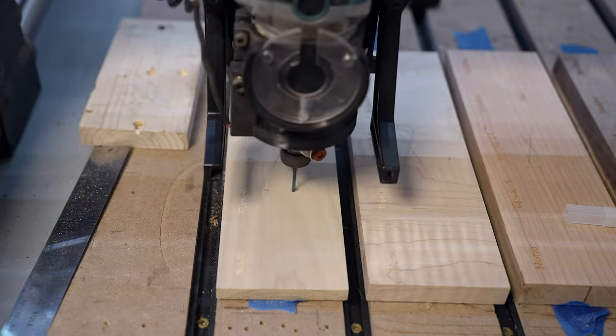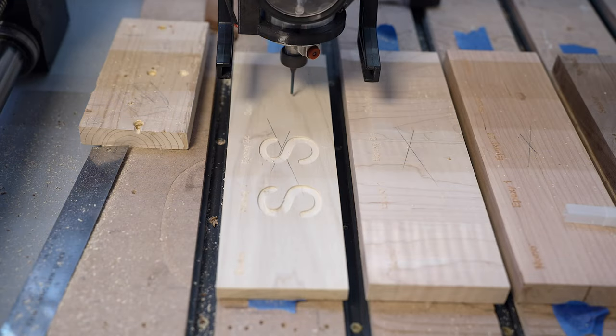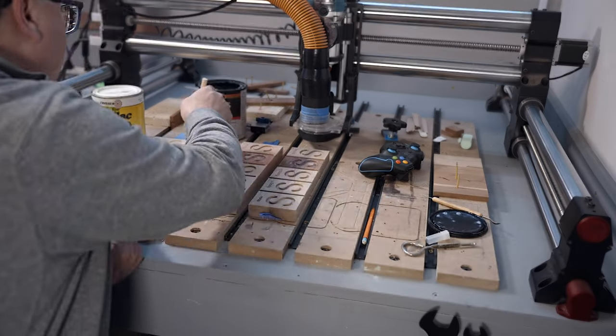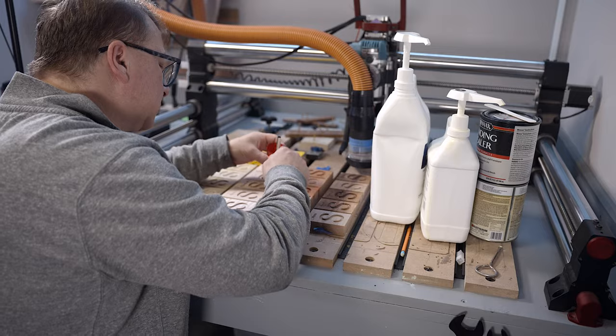I used my trusty Onefinity to mill the pockets. I used a one-eighth inch down-cut spiral end mill, a one-eighth inch depth of cut, and a feed rate of 80 inches per minute. After all the cuts were made, I did a little bit of cleanup in areas where there were fuzzies left. All the pockets looked great, so I started the sealing process. I started with sanding sealer, then I moved to shellac, and then the epoxy that would cure for 24 hours. The next day, I sealed the final pocket and let it cure for just over an hour. I used TotalBoat high-performance epoxy with medium hardener for all the pours — that is my go-to epoxy for shallow pours that need to harden overnight. For deeper pours, I've been using Super Clear Liquid Glass and getting amazing results. I will leave a link to both below in the description.